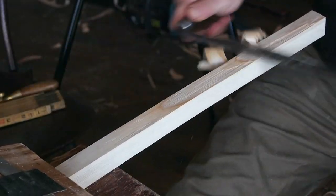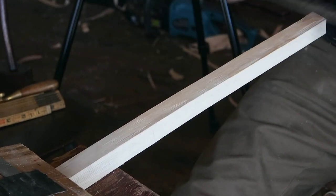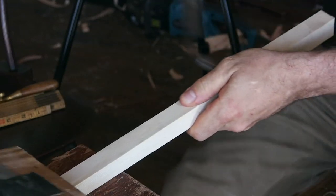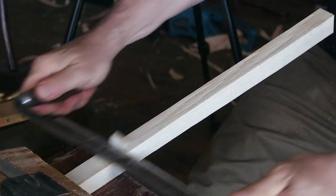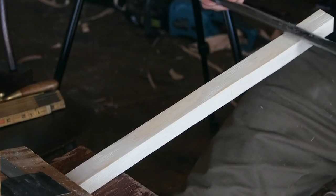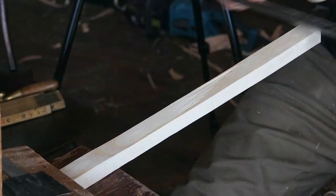So here you're gonna see me shaving a piece of wood that does have the tangential and radial planes aligned as though it was a split piece. And you can really see right there, it was very simple and clear to chase those growth rings right off the edge. I just started out here on the tangential surface, chase them right off the edge, and because the other surfaces were split, I'm really right in the ballpark.